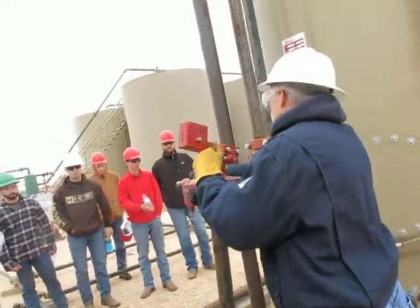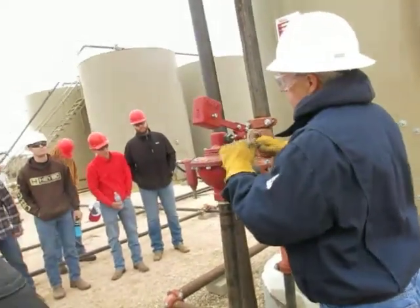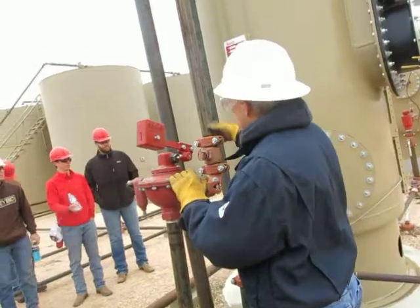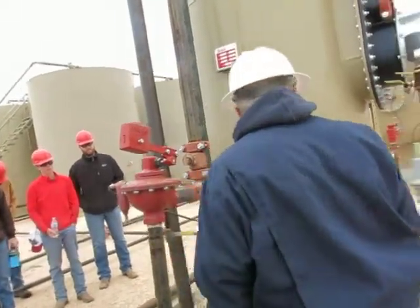And notice here, coming off the gas system, that's equalizing the pressure on here. So we've equalized the gas pressure. We're only working off the hydrostatic end. Same is true on the water side over there.